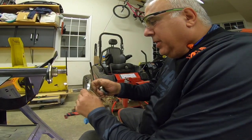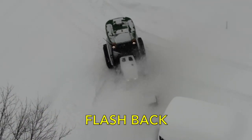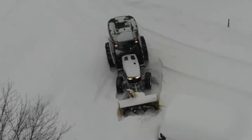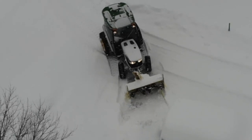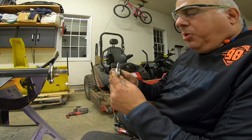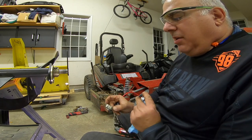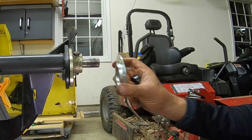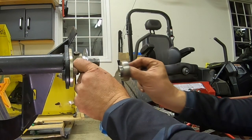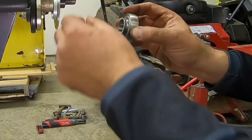The part that got bent up — the bearing actually pulled through. This piece sits behind the bearing, and when I got caught on the pole strap while snow blowing, this piece went around the bearing and the whole axle pulled through. I do a much better job explaining how the bearing gets reassembled and how the cam bearing lock works on the other side, so we'll move ahead to the disassembly of that side in this video, and then I'll explain the reassembly in a couple of minutes.